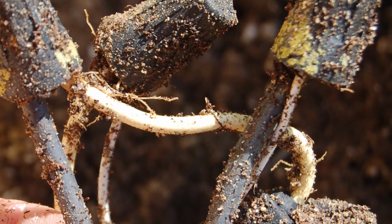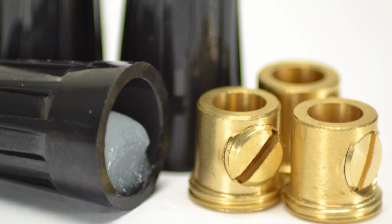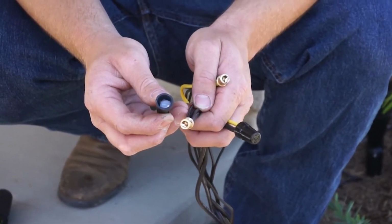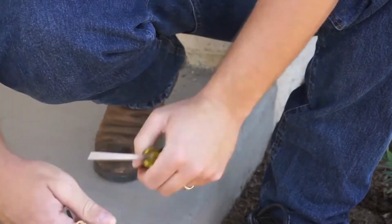Because connections are so critical, each type of Unique Lighting hub includes secure connection types, specifically for outdoor use. Satellite hubs include a brass barrel connection threaded at the base and cap for a secure closure and moisture barrier. Brass barrel connections are filled with silicone grease. The cap threads onto the barrel. Use the flathead screw to crimp down the wires and make a solid connection.